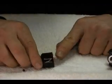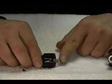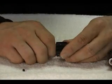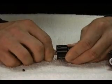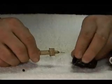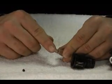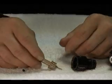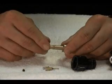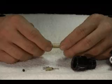Once the bonnet is removed, notice the piston is extending out of the bonnet. Grab the end of the piston, and while wiggling the piston back and forth, gently pull it out. If you use a tool, you could damage the end of the piston. Replace the piston with a new one from a Ninja rebuild kit.